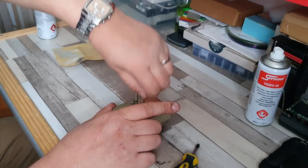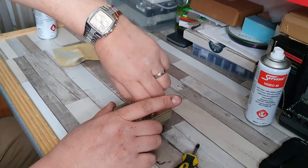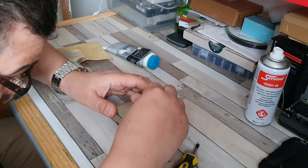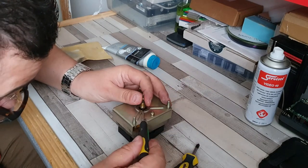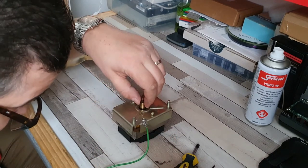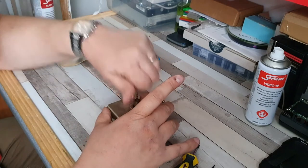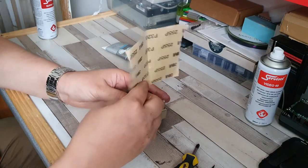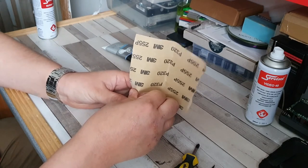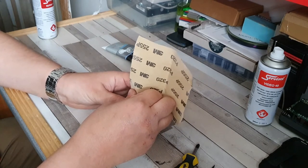There's not much movement or play, and it's rotating quite nicely now. Final thing is to put the little lock collar back in - this goes down onto there and then we just screw this onto the shaft. Now the big test is will it work. What I'm going to do first is because there is a bit of belt residue on the motor pulley, we will clean that off - that will serve me in good stead when I come to replace the belt itself.